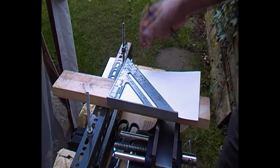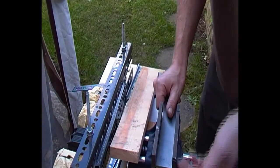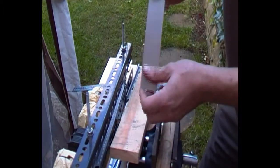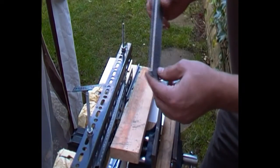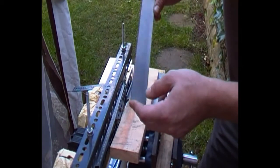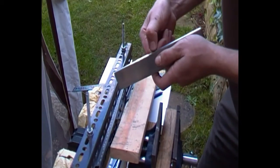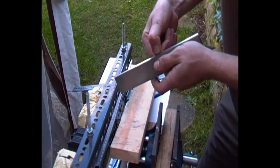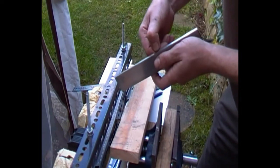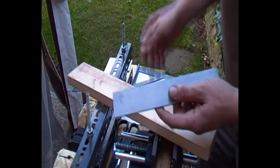Normally you'll start off with your steel — the knife blade itself. I haven't cut one out yet because I haven't got a need for this knife shape at the moment, but I will be shortly. This is 4mm stock, so originally you'd need to scribe a line right down the center of the edge — 2mm from each side.